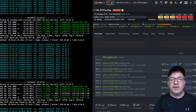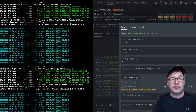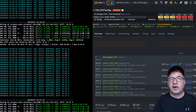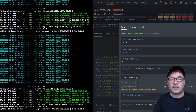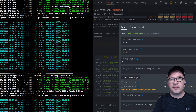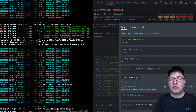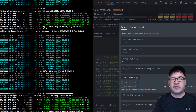The next card I tested was my RTX 3070 Ti — another EVGA XC3. I used a locked core clock of 1290 and a memory clock offset of +1500, getting 71 MH/s but consuming 271 watts, so it's not very efficient. Next was my RTX 3080 with a locked core clock of 1080 and a memory clock offset of +1000. My card needs some thermal pad work because it's running hotter than it should — I have to dial the fan up to about 100% just to keep it around 90°C. Overall I was getting 87.72 MH/s using about 269 watts.